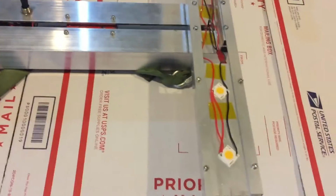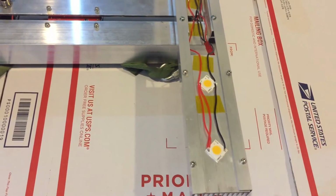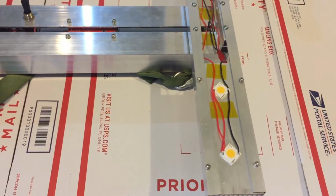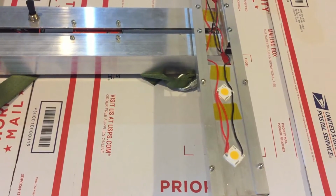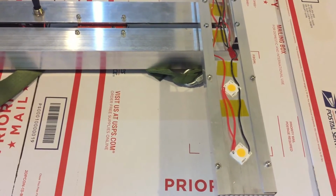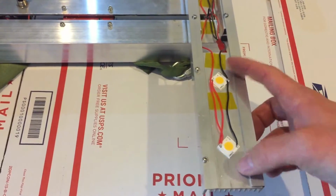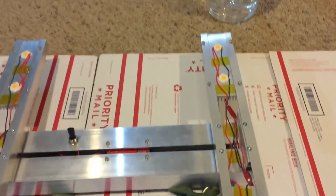And that's not good. So what you can do is use really well matched LEDs, which these are according to the data sheet, which we'll go have a ponder at next. According to the data sheet, the difference would be like 7% max, because Cree bins them, or sorts them, based on different power and color characteristics. And so that's one thing you can do to keep them sharing current equally, or more equally. And another thing is just to keep them the same temperature, right? So we have them on the same heat sink. This is a 6-inch heat sink.